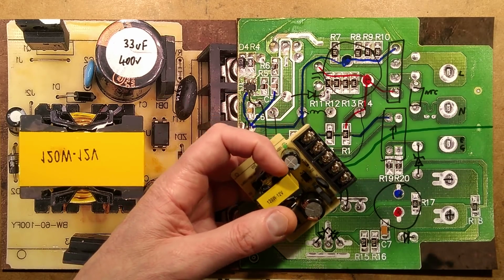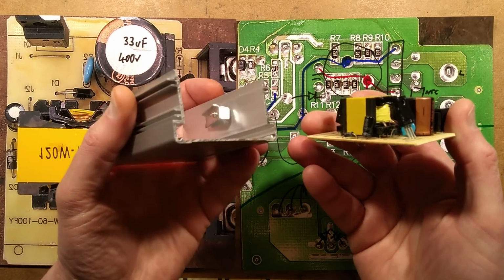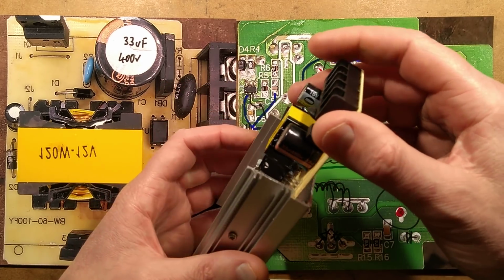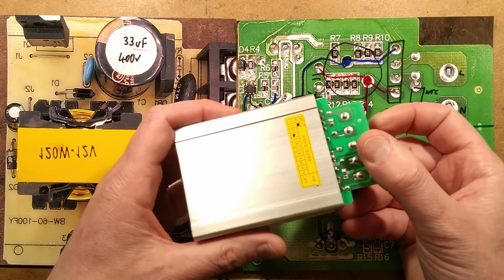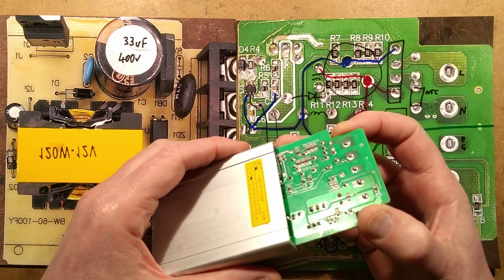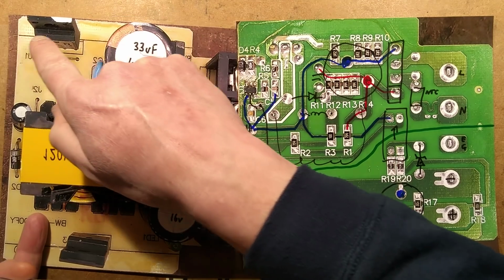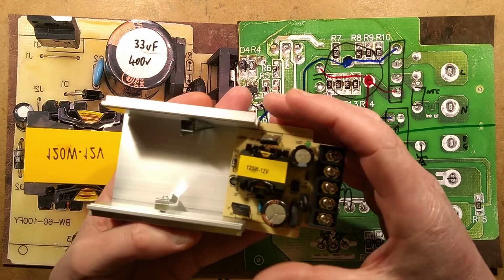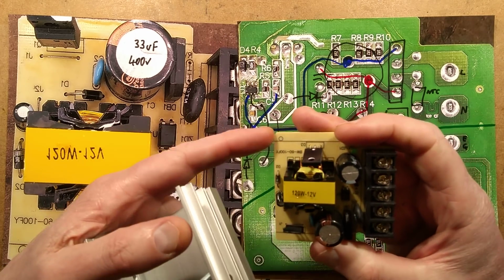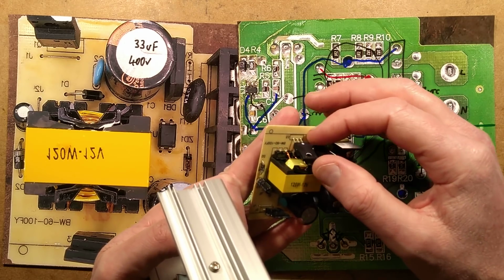And certainly, when you slide this into the case, this unearthed case, it slides in this little rail at the bottom that keeps the circuit board well away from the base here. Well, not if there's insects involved. But the spacing between, say for instance, that live track and the side, it's about 3mm, which is reasonable enough. And the top, they've actually got a line. You can see the line here and one here that represents where this case actually kicks in. And the metal will be in that vicinity, but that means it's just a couple of millimeters away from the MOSFET connections.